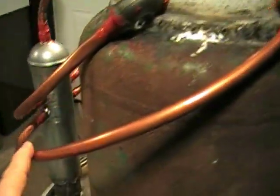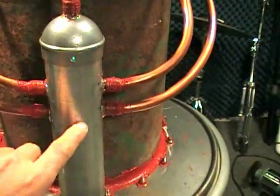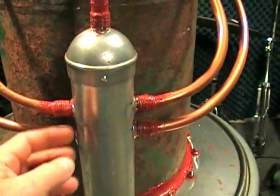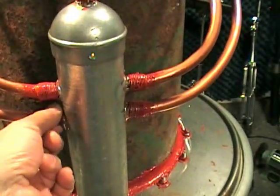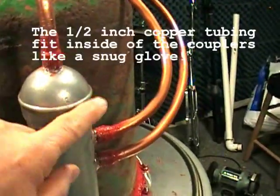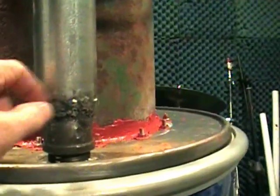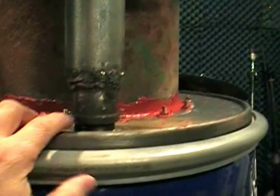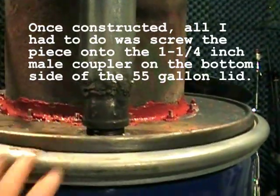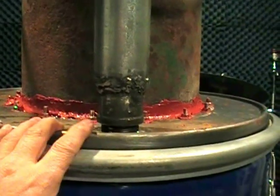I used half-inch copper pipe. Basically what I've got right here — I went and bought some fence post, a two-and-a-half inch fence post, with a top to go on it. Since I've got five nozzles, I tapped five holes on this thing and got couplers that went in here — I actually took the time to thread them in. So even in this lid around there, there is RTV cement. I took this guy and went to the bottom and put a bunch of little slices all the way around it, bent it in, then took a one-and-a-quarter inch iron coupler, let those claws grab it, and welded it in there. I had to tack weld it 5,000 times because when you start welding on something real thin, it's so easy to burn through it.